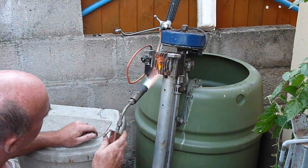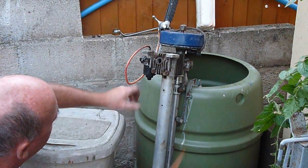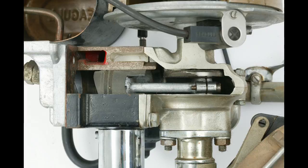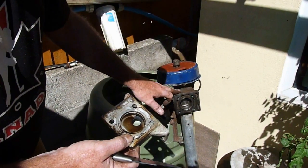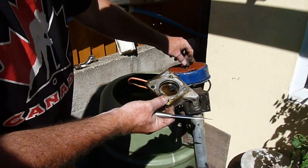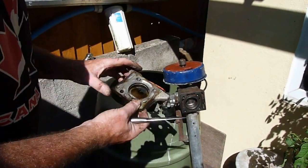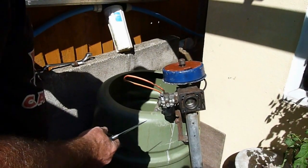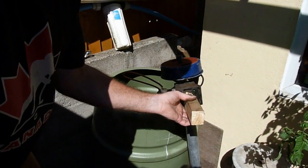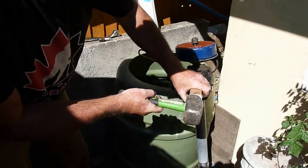It's totally seized. It'll take a lot of care not to burn the carburetor as it's getting a little bit hot. After warming the block and putting Plus Gas inside, we've removed the cylinder head and tried to free it up using a flywheel bar, but to no avail. You'll need to replace the gasket, so get a new one. What we've done is cut a piece of wood so it fits inside, then we're using a large hammer for the weight.